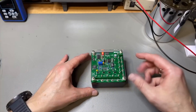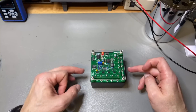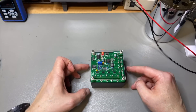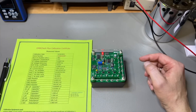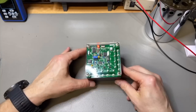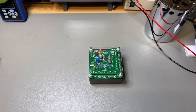To have the reference working properly you need to have it switched on for at least 20 to 30 minutes — then it becomes more and more stable. You receive the device already burned in for at least 250 hours, because after that the circuitry really starts to settle. This one came with almost 500 hours burned in but I have been using it for three years, so it is pretty stable. It can only run on batteries, and it would be even better if you leave it switched on all the time — so they thought about this in Revision 8.